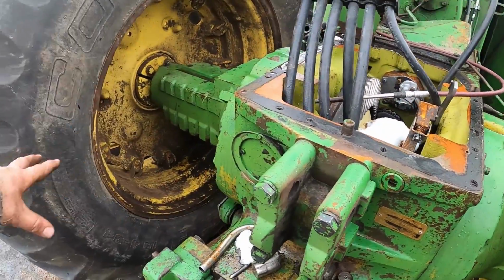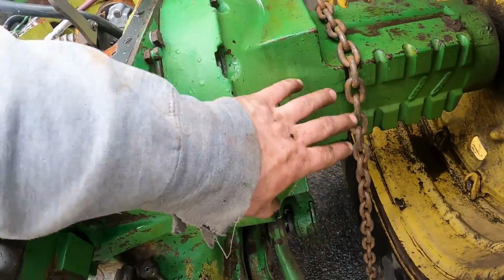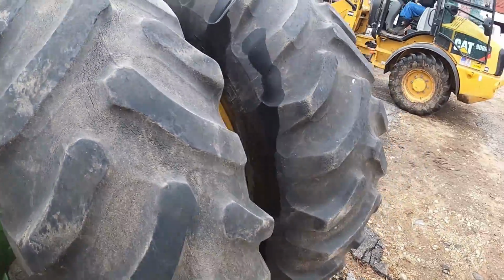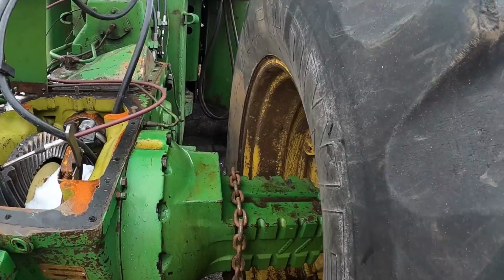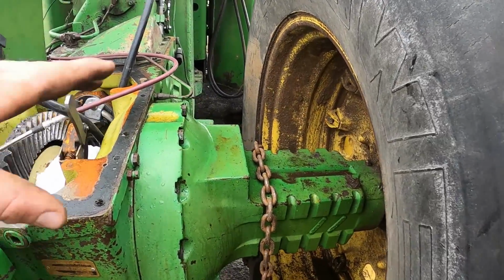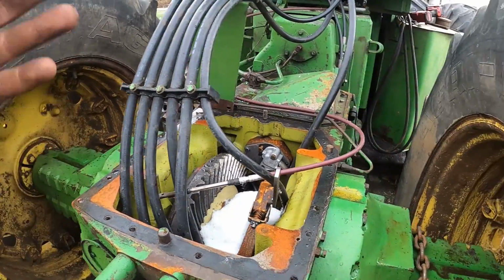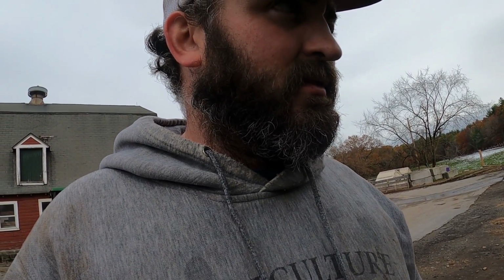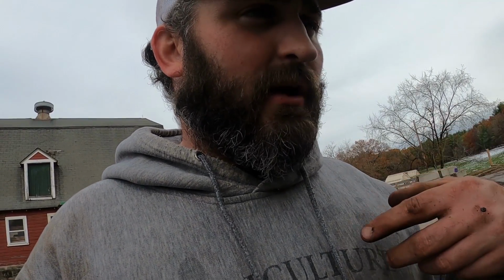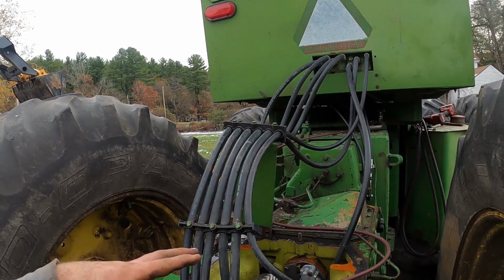So here we go. So got the tires on that because I needed the jacks out of it. So I took out all the bolts except for 2 up here at the top that hold the axles on. Loader's gonna come in, pick up underneath. I'll chain the top of it just so it has something to hold it with. Take these 2 bolts off. He's gonna back out, do the same thing on the other side, and then it's just, I don't know, 10 bolts, 12 bolts outside and 3 inside, and the whole transmission is going to come backwards, and a few lines.